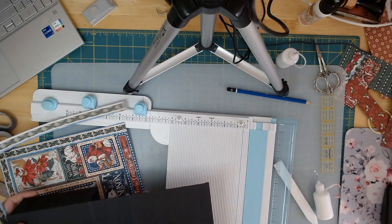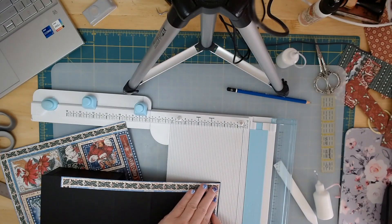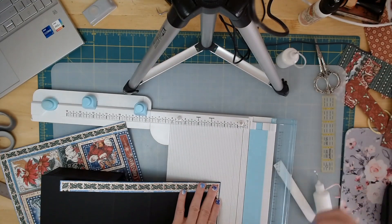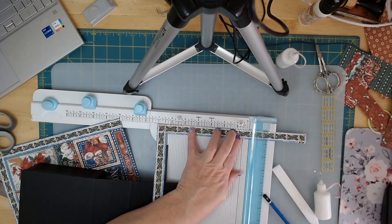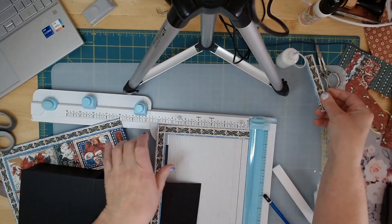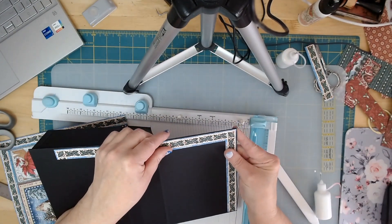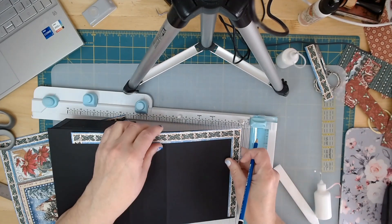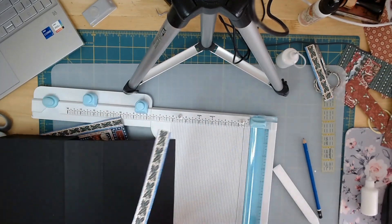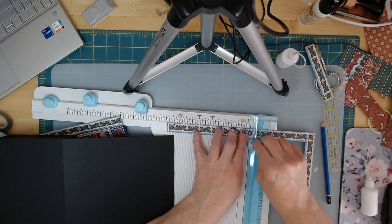I'm going to tick mine — place it where I want it to be, come down here, and mark it with a little notch. I want to cut at about that notch. Save that piece — you might be able to use it. Then I'll do the same thing on this side: put it in the corner where I think I want it, bring it over close to the edge, and put my notch on the cut line and cut.